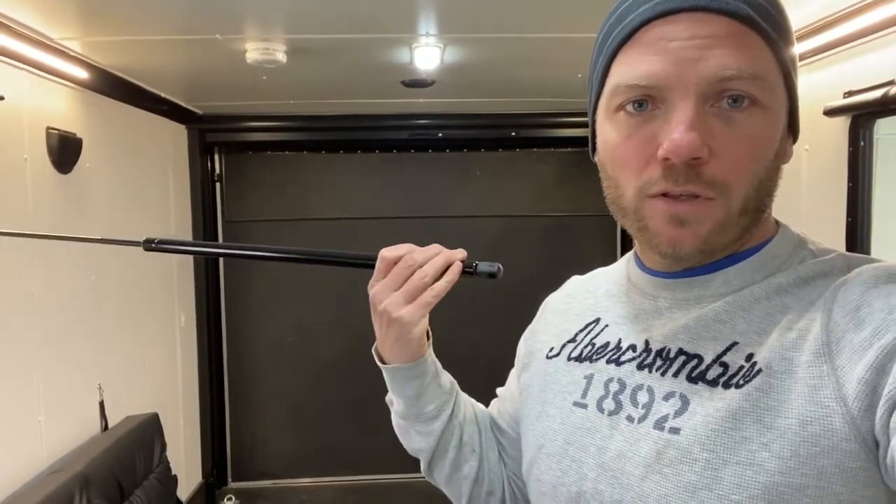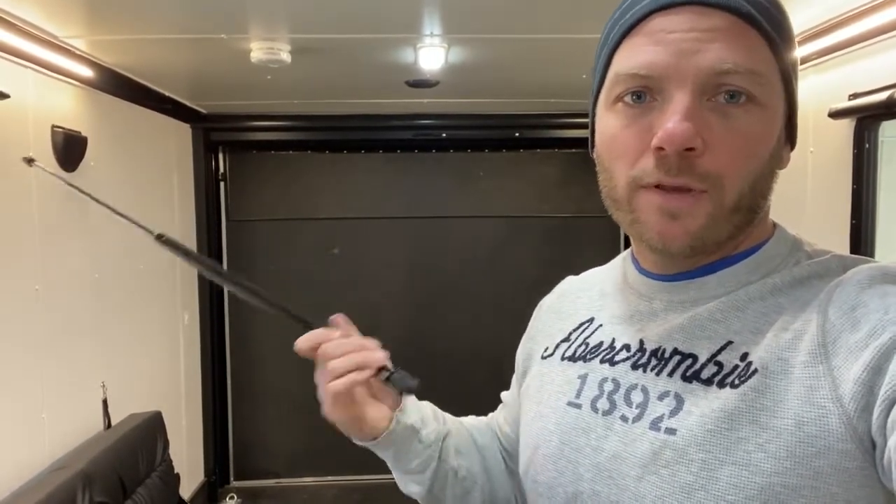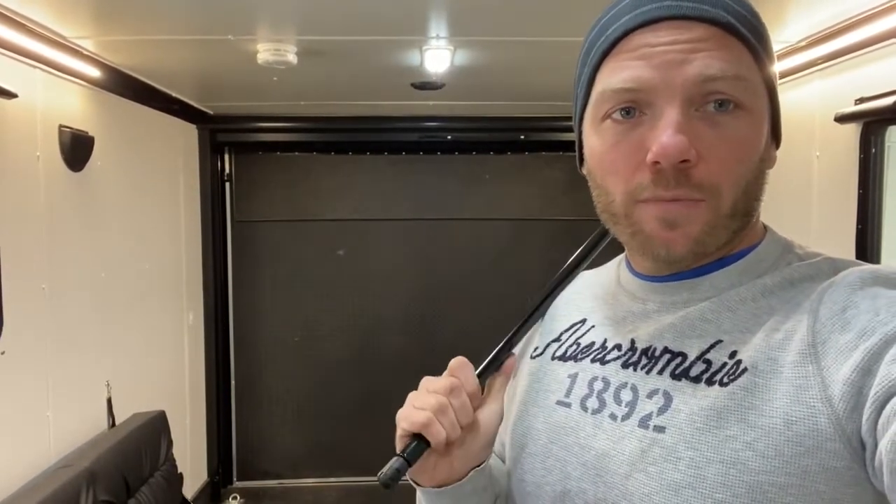So what I'm going to do is build a bed frame out of angle iron and some square tubing. I'm going to use some one-bys for the flat part, and run some square tubing rails on the sides that it'll slide up and down on. I've got a couple of 90-pound struts that I'm going to use to push the bed up to the ceiling, and then probably put some pins in it to hold it up. So we're going to give this a shot and have a little fun project.